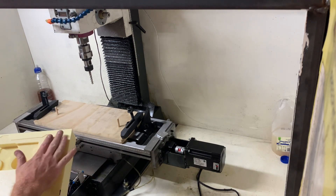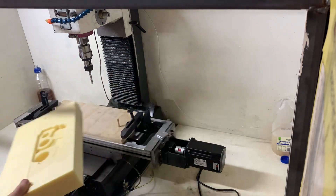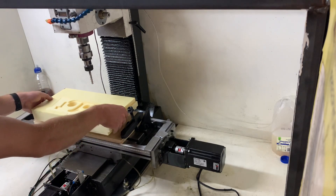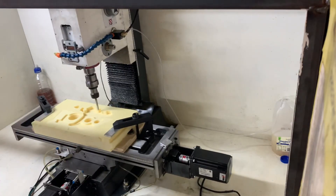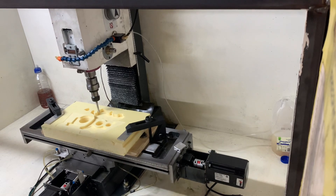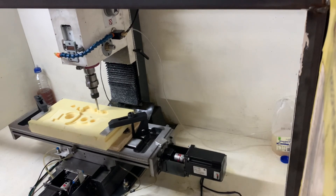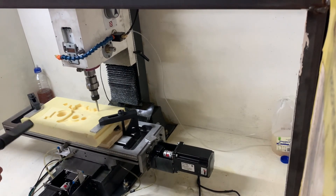I also added material around all the critical points that would be machined after casting. The next thing was to work out how big the model was and whether I could machine the entire piece of foam in two operations — one for each side. After further examination, I decided I would need four operations, as my DIY CNC milling machine just didn't quite have the Y-axis travel required to do it in two.